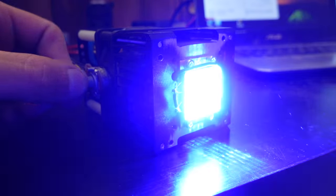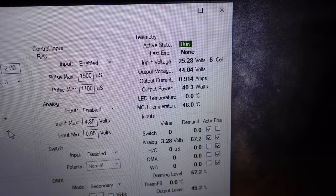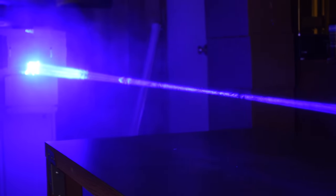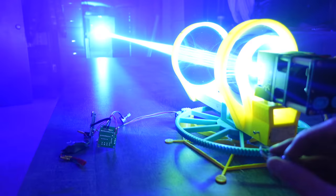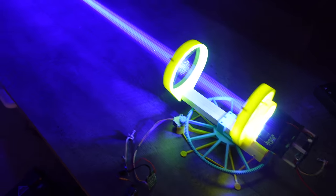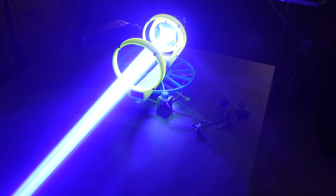Initially I had it configured to do 80 watts at full throttle, but over time that seemed to creep up to 120 watts, probably from thermal damage after running it continuously for several weeks. Looking through the laser goggles, we can see the beam is a square, and as we get further away from the array it gets larger. After some experimentation, I found that shining it through a few big lenses caused the beam to converge into a smaller point about 5 feet away. That should increase the cutting power quite a bit. But don't get me wrong — this thing is still insanely dangerous. Even just the stray reflections coming off the lens could blind you.